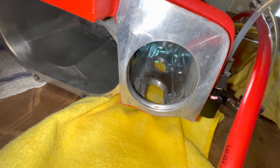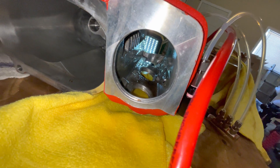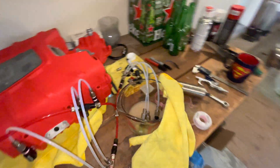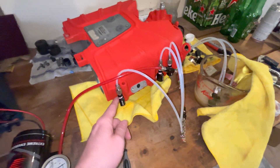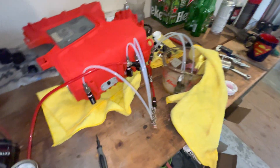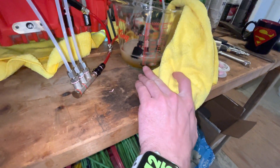So they're going right into the ports. The blower is ported. So what we've figured out is each nozzle - every single one of these one-gallon-per-hours will actually flow at 150 psi - it's flowing exactly 100 milliliters.